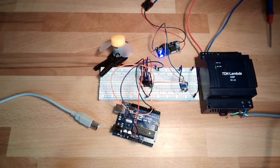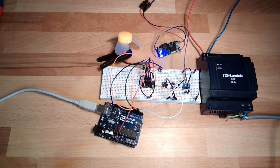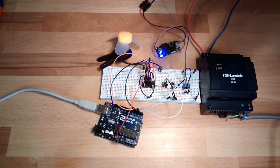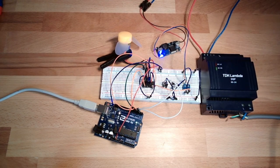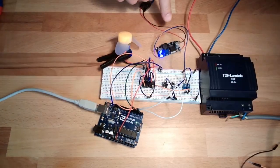This is the L293D motor driver. Looking at the datasheet, the maximum voltage for this L293D motor driver is 36 volts, so the secondary voltage should not be above 36 volts. However, this is usually enough — you could also use this motor driver to drive, for example, 24-volt relays. Now this is your task: add two buttons, one for increasing and one for decreasing speed. Please use your standard power supply which is part of your delivery.